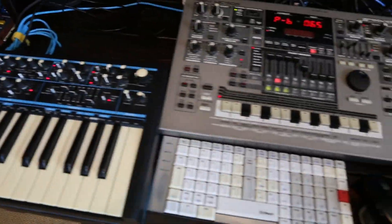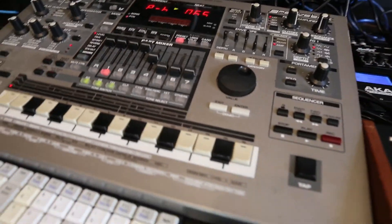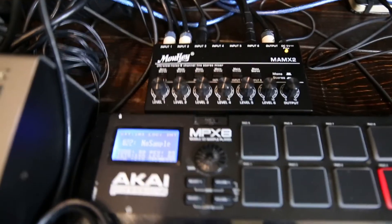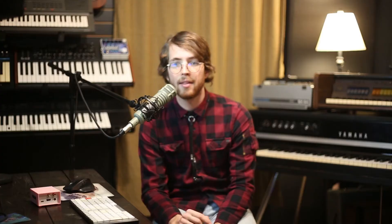Okay, now that we're done with the nitty gritty, let's get to the fun part. In my live setup, I've got two synthesizers — the Bass Station 2 and Moog DFAM X4 — and a drum machine, the MC-505. I also use this for some extra sounds when needed since it has its own sampling and synth engine that can be used for much more than just percussion. I'm also using an Akai MPX-8 to trigger the songs that I want, and a Mu-Key MAM-X2 to mix all of these line levels together. The Akai MPX-8 is connected directly to the OctoPi's MIDI in to control it, and then the rest of the devices are daisy-chained together from the output of the OctoPi MIDI out. For each device, make sure that the MIDI through output is configured correctly to prevent the OctoPi's messages from getting stripped out at any point in the chain.